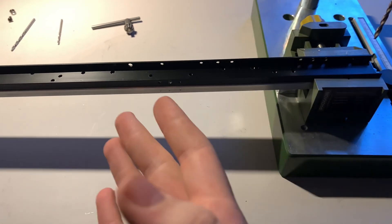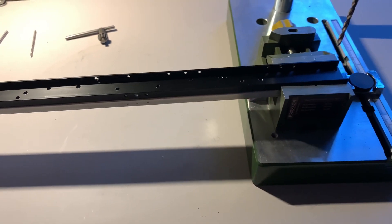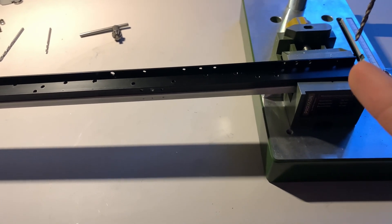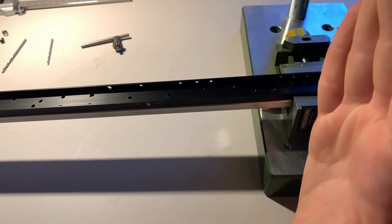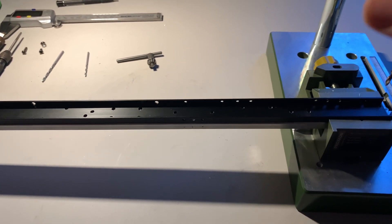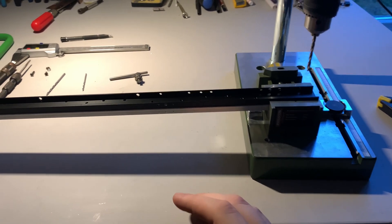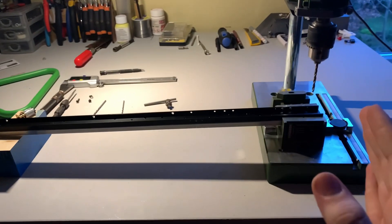The best way to do it: when people are building trucks I always recommend locking your gearbox in either first or second gear — you don't need third. Where your servo mount is for your gearbox, the best thing to do is mount the servo on the gearbox itself. With the links in the kit you can make it turn directly from the front of the truck onto the axle, which removes a lot of the servo steering slack and makes the truck steer a lot tighter.